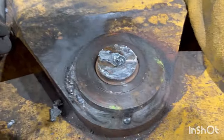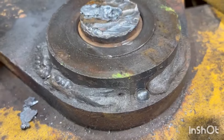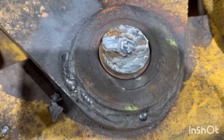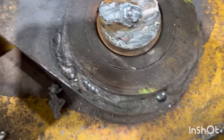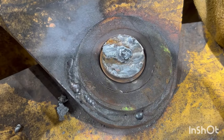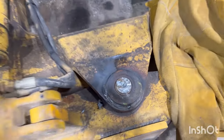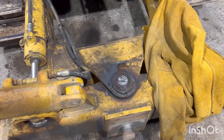Here's what I did - I air arc'd that washer off the top. It's got a little bit of shoulder right there that makes it smaller than the actual bore that washer sat on. Put a little dimple right in the middle of the top. As near as I can tell it is not hung up in this top bushing - it's all on the bottom. I'm gonna give that a few good blows with the sledgehammer and see if it moves. If not I've got a jackhammer for rocks I'm gonna set right on the top of that and try to drive this pin out of there.